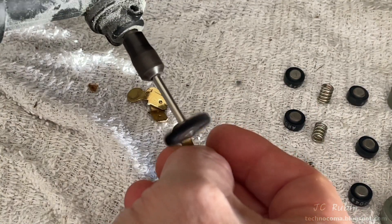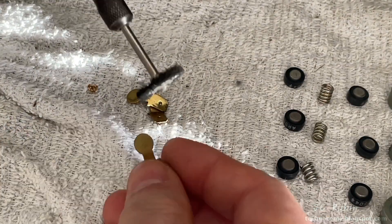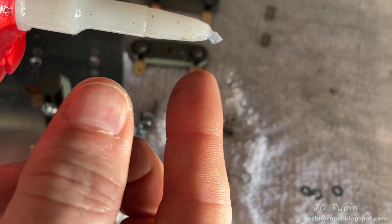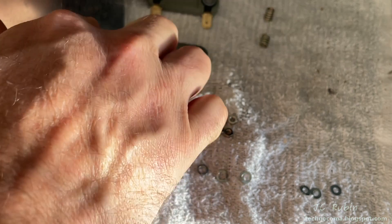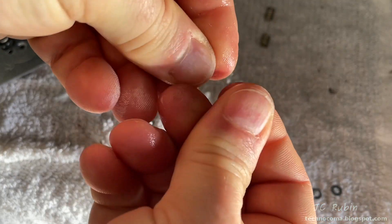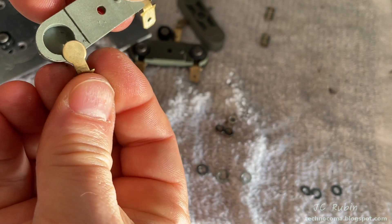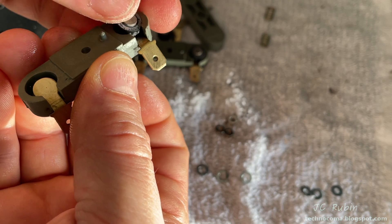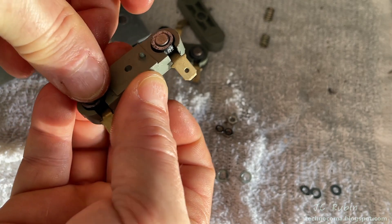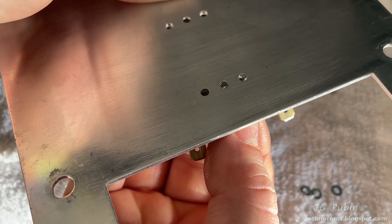All the oxidation is cleaned off the metal pieces with a Dremel using a wire brush, followed by a final cleaning with paper towel and carb cleaner. Each area where the diodes contact the metal plate gets a small amount of dielectric grease — very thin layers also applied to the contact pieces. The pieces are installed into the plastic in the correct direction, and the diodes are then installed with the silver side facing upwards.